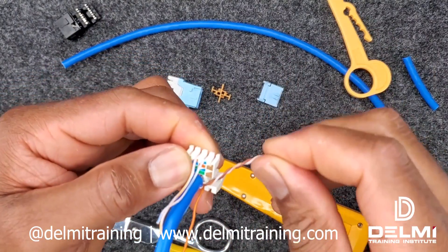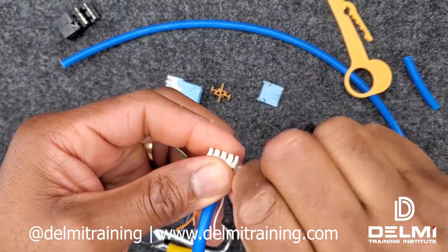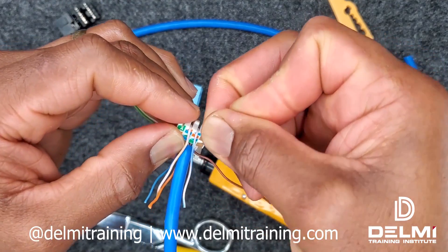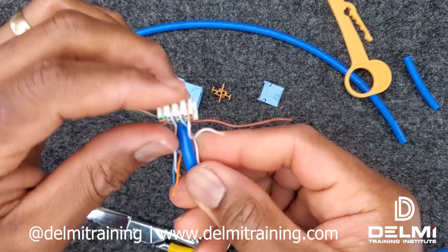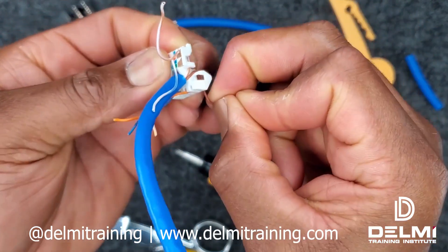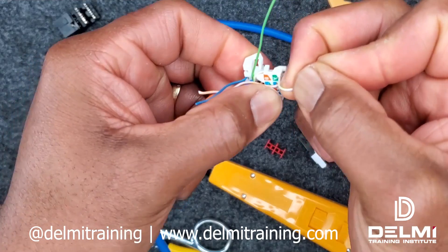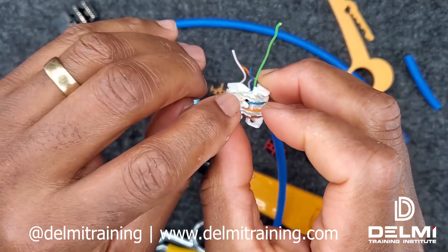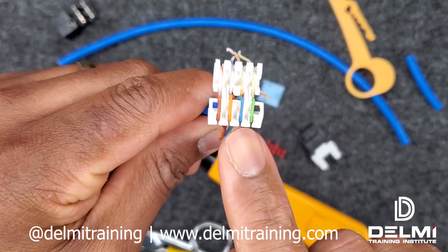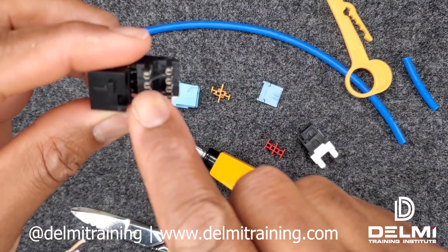I'm going to move on to my brown pair. I'm going to untwist it and take out any excess twist within the strands. The top part is my white brown — I'm going to take that and feed it through the groove. The brown feeds into the groove on the back side, so I take that, feed it in here and bring it all the way up. My white green goes all the way up through the groove, and then my solid green goes all the way down and up. You have to ensure you have a nice clean layout and that they make contact with the exposed metal in the connector.